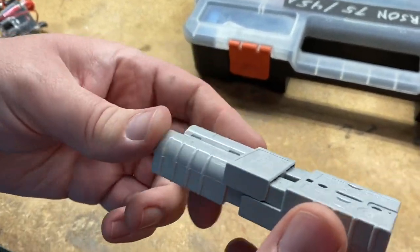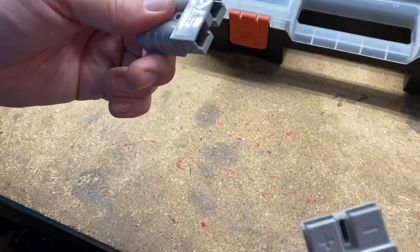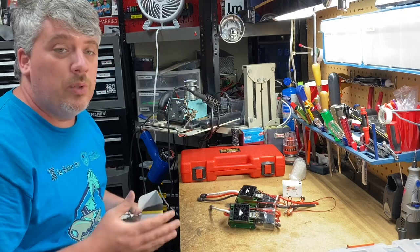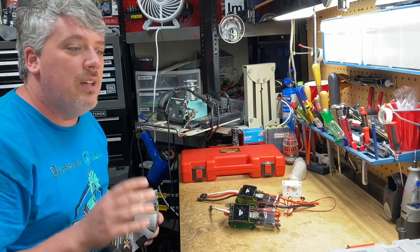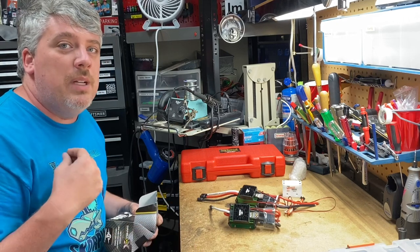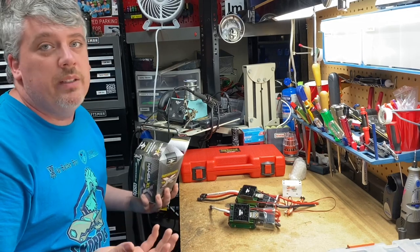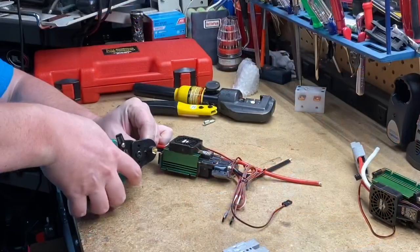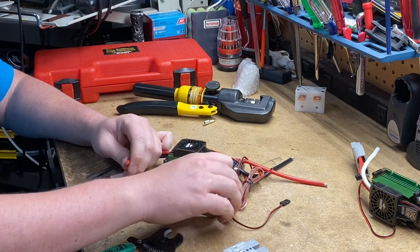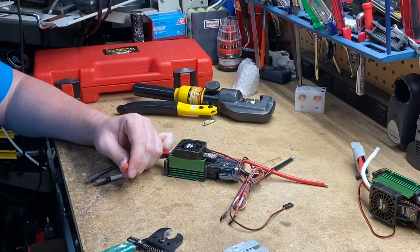It's very important — everything has connectors going between it. That way you can service the robot faster when you're in the pit area if you need to pull sections away or pull certain components out. If you direct wire and solder everything, that means you have to unsolder it when the time comes to replace it or work on it. They just came out with a new one which we're actually going to put in our weapon system this year and test it, to make sure it's just as reliable as the XLX.